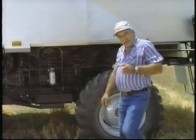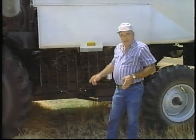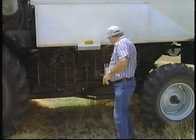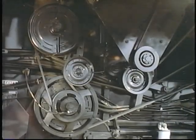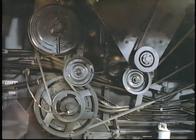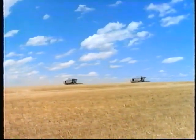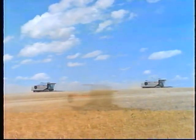This whole idea of reliability and serviceability applies to the entire combine, not just the engine. During assembly, we pay close attention to details that make your job easier. We build the Gleaner Series 2 around a solid one-piece all-welded frame that keeps shafts, bearings, sprockets, and chains in alignment to reduce wear. And we make the flighting on the end of the auger a little wider to wear longer. Our cylinder bars and accelerator rolls are replaceable in sections, so maintenance is easier and more economical. Even our belts are better — they're made of an incredibly strong material called Kevlar — and now there are fewer of them, and fewer drives too. They're all accessible from outside of the main frame, no climbing around to get to them. We even have a fast-access cylinder panel, so you can remove the entire cylinder quick and easy.